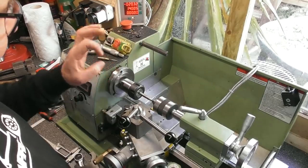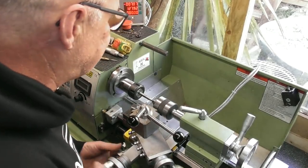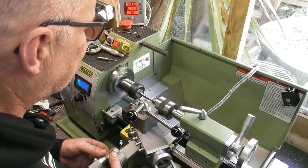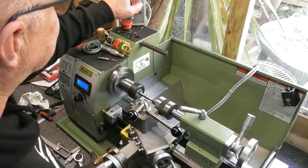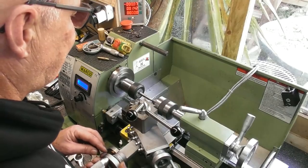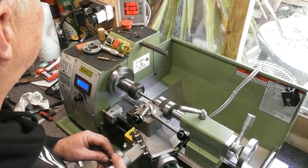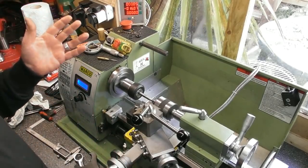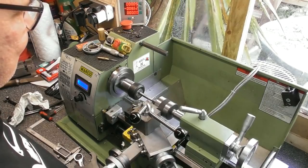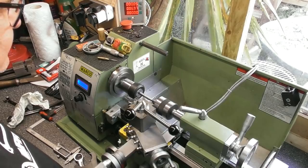We'll do the knurl before we machine the rest of the dart down, because I want as much meat in the dart as I can when knurling it. I'm going to try running it at around 600 RPM. That just touched — a bit of a heavy touch, we'll try that again. A little bit of an intimate touch on there. Set a zero on the diameter. I'll take 0.1 off it and see what happens — see how the feeds and speeds go. It's a long time since I've machined any tungsten. Going at 8.25 now. Yeah, seems quite nice, lovely finish.